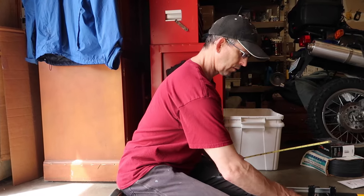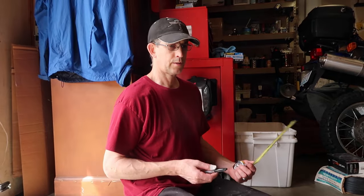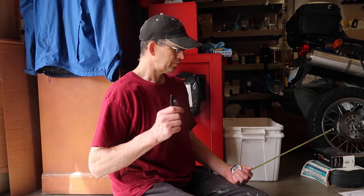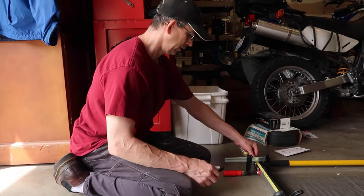I've got clamps on each grommet position, so I'm not going to put screws in those yet. What I'm going to do is mark my 3 screws in between, put all those screws in, I'll take the clamps off, and then I'll screw in through the grommets. Okay, so I'm going to mark my 3 locations in between each grommet, and given that this is such a high quality tarp, they're all unequally spaced. You could eyeball it, it wouldn't matter that much, but I go and measure it.